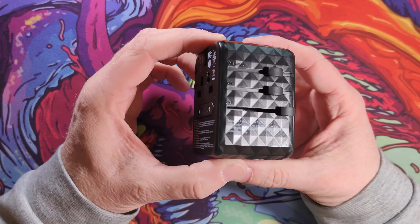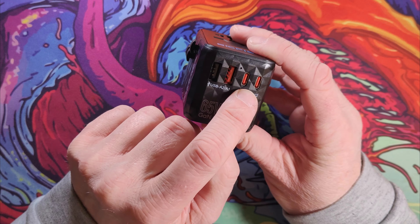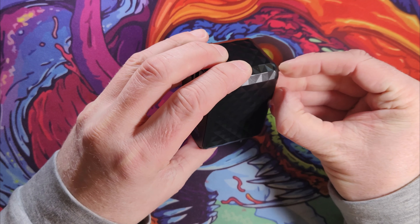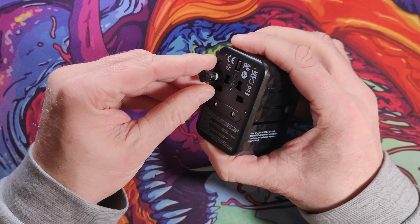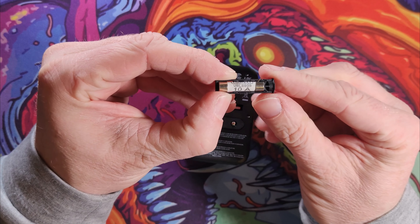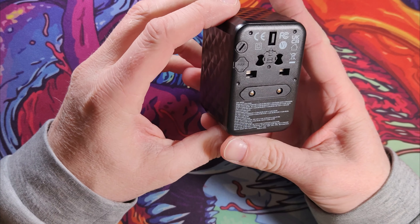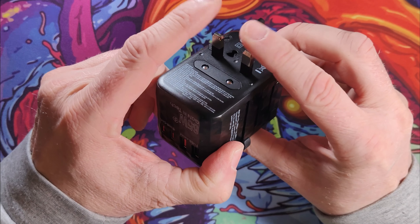So we've got the UK one, which I will actually use — I'm going to use this as a charger, not just a travel adapter. As you can see it says 65 watts. It's got two USB-A sockets, one of them's a fast one, and two USB-Cs, which should both be fast ones. It does apparently have a fuse and a spare fuse — if you pop this off, there should be a fuse located in there. It's a standard size 10-amp fuse. It comes with a spare one, which is handy, so if you accidentally overload it it's not the end of the world. And these aren't going to accidentally push in, so that's good.